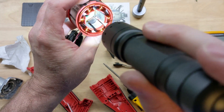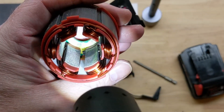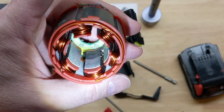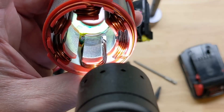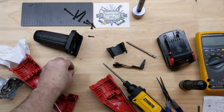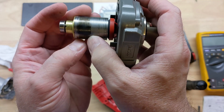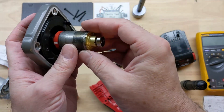The more and more we clean and look, on the pole right here of the stator, you can actually see where the plastic behind all your laminations on the pole is actually smeared and melted. The rotor was absolutely touching back there. So these little metal pieces that look like hair — I believe they actually came off of here. We can see some plastic on here as well. A stator and rotor does have very minimal clearance, and that's on every motor design, especially BLDCs and little servos. It's not uncommon for them to be close in tolerance on clearance.